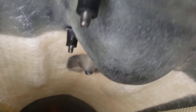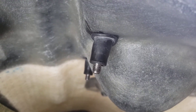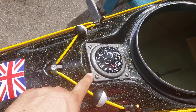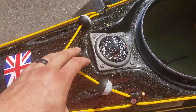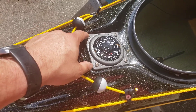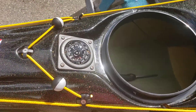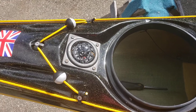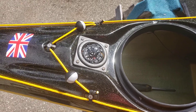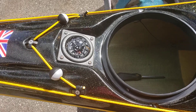We've gel coated the holes and then installed well nuts. These well nuts are going to keep water from coming in, and gel coating the holes will hopefully prevent water from permeating the mat in the middle of the hull. Then I've got banjo washers on the outside that should serve as the seal to keep water from going in in the first place. That's the best approach I can take without doing the fiberglass work on the inside, which will probably come later — maybe this winter.